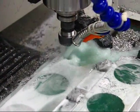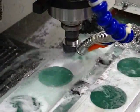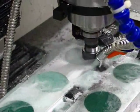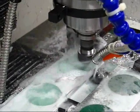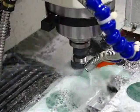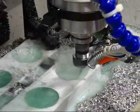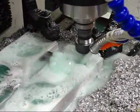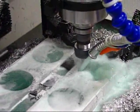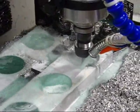I've got some chatter problems with the finishing operation on the wall of the pocket right here, and there'll be another one around on the other side, 180 degrees from that, but at the second cut it's not a problem for some reason. As long as I'm not getting tool pullout, I think I'm okay with the surface finish. When I checked it on the first pocket, the surface finish wasn't in bad shape — it looked good. I'll just address this and maybe change the depth of cut for production.